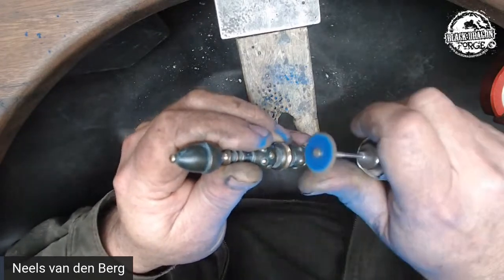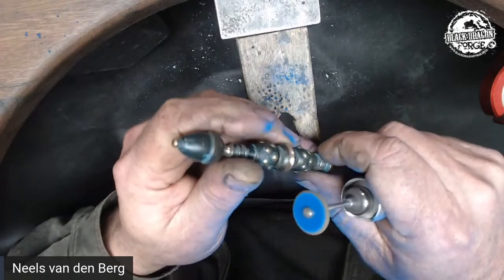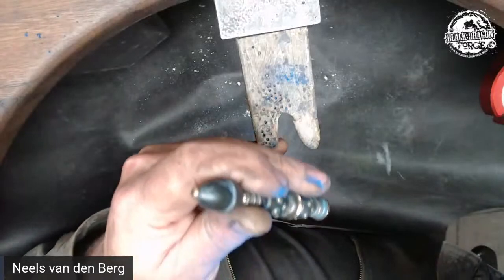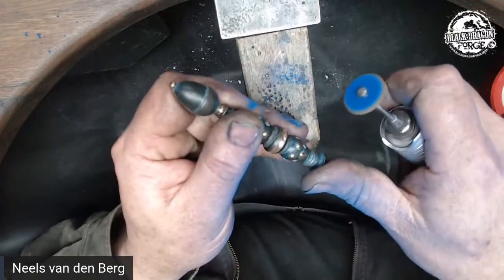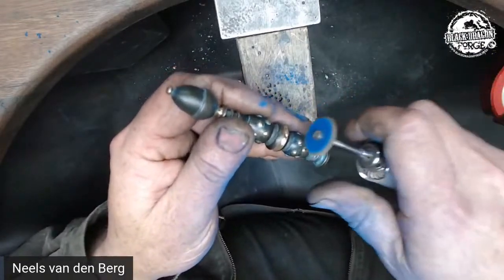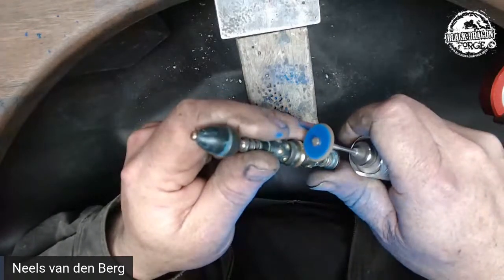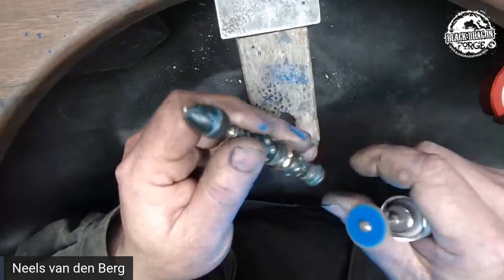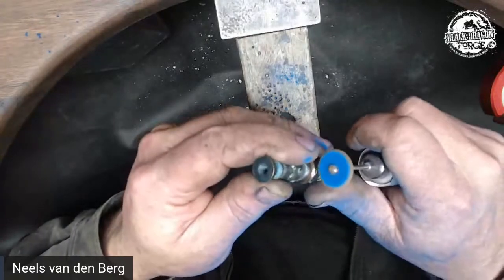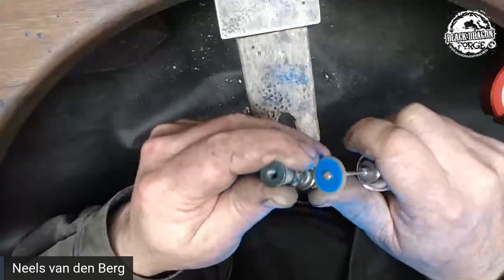When I say really slowly, I mean extremely carefully — you don't want to slip. You'll also notice that my hands are supported all the way on the bench peg. I've got my two fingers linked in, sitting on top, and my thumb sits on the workpiece. The workpiece is held by four fingers and I'm rotating and supporting. Nothing is hanging in the air. Feathering not the cut but the cleanup, then turning around, working in the opposite direction, just to make sure I'm getting both edges on both sides nice and clean. Those edges are sharp and I do want them to pop.